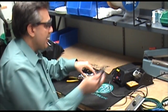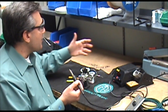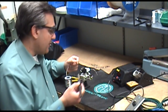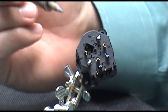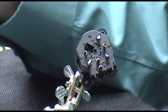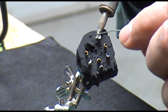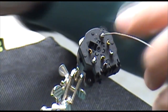I'll start by filling up my solder cups with a small amount of solder on my Combo Connector, so it'll make it easier to assemble the lead wire to it in a moment. It doesn't matter what order you do this in, just as long as you're careful. You don't need to over-solder. I've filled in the tip, ring, and sleeve contacts. Now I'm going to take my lead wire and start attaching it — beginning with the tip. I'll heat up a little bit of the solder, stick the lead on there, and cut it off.